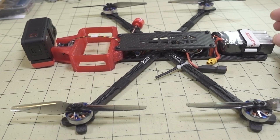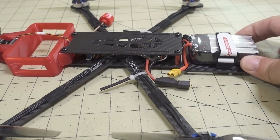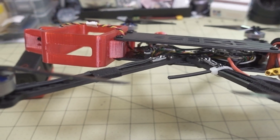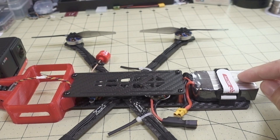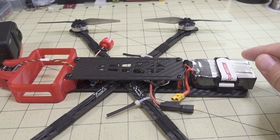This is why the drone is so thin. I believe the height limit is around 22 millimeters, which also means your battery selection is going to depend on that — you're going to want something that fits within that height requirement. In this case I'm using a 1000mAh outlaw-style battery, one of those long-range cruising type batteries.